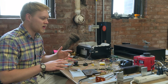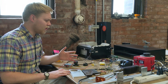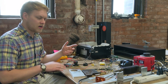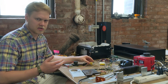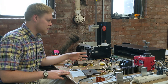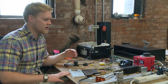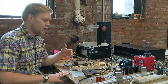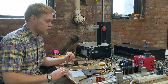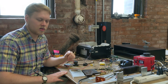This machine that I'm working on here is kind of a hybrid system that I've never seen before. I think it's a really good compromise between simplicity — something you can do at home — and effectiveness. I'm not controlling the actual characteristics of the spark itself; once the spark occurs, the characteristics are still limited by the capacitor and system resistance. But I do have an Arduino that controls the spark frequency and spark duration, which makes it a lot more efficient and achieves a faster spark rate, so it can machine metal a lot faster than a traditional RC EDM.